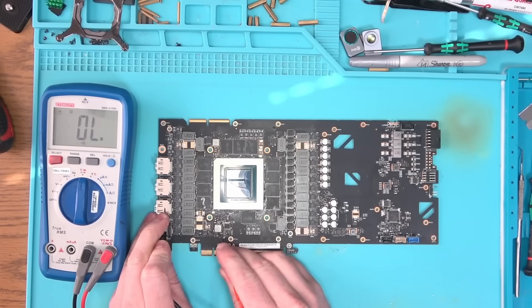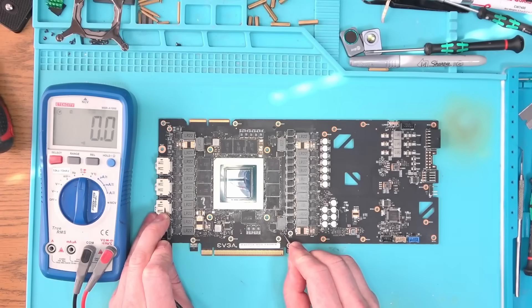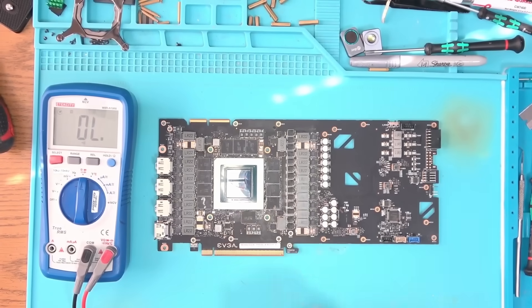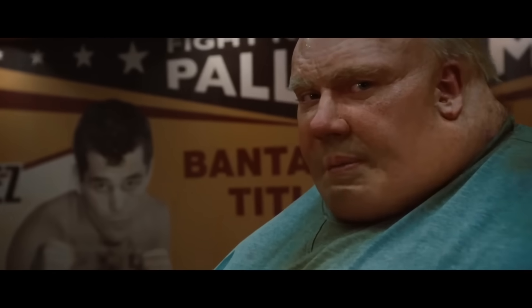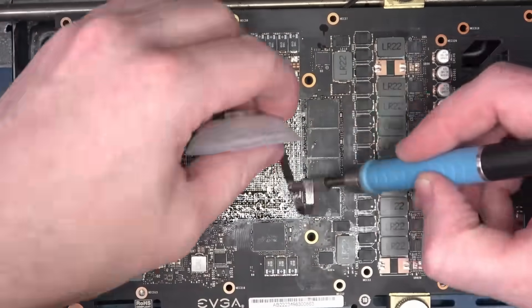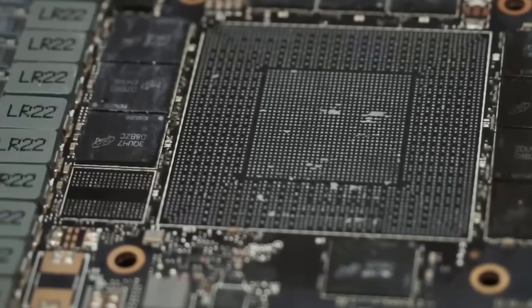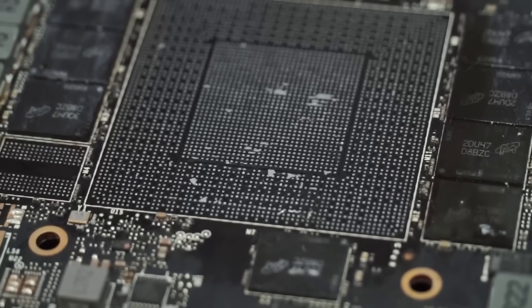As a result of all that hard work, we have a short on memory. My guess is that the solder was flowing under the mask, and as I said earlier, shorted something along its path. So let's remove the core and find the blob. The worst thing about this type of damage is that the more you fix it, the worse it gets with every attempt. As you can see, I now have a lot more mask that came loose, and no matter how careful you can be, it will continue to get worse.